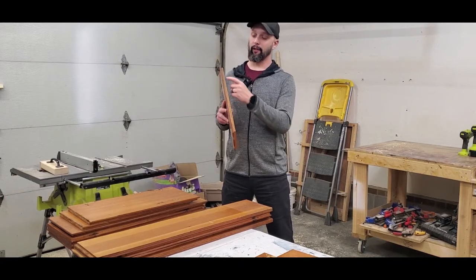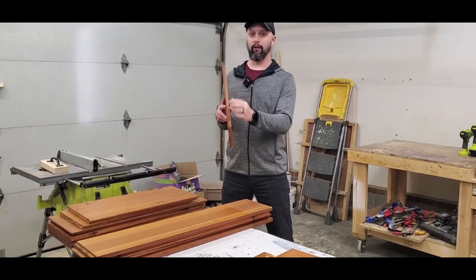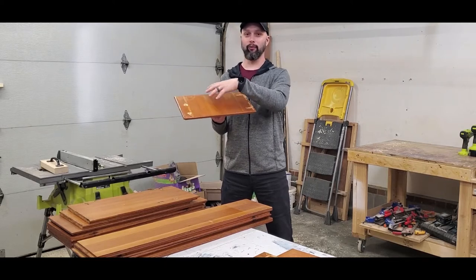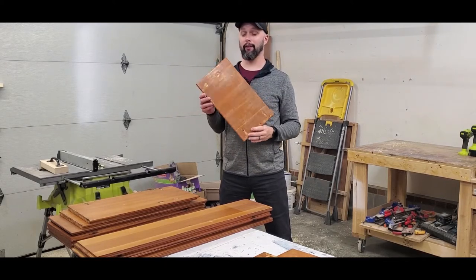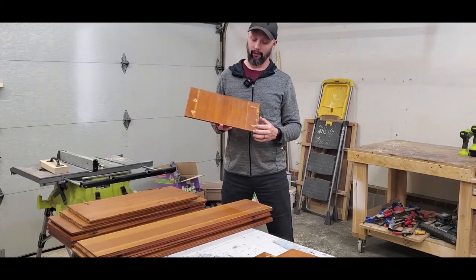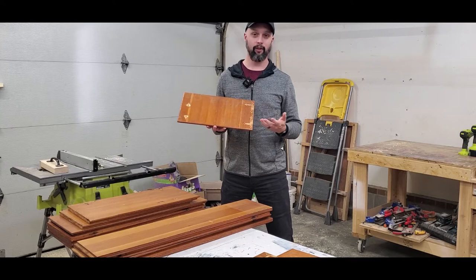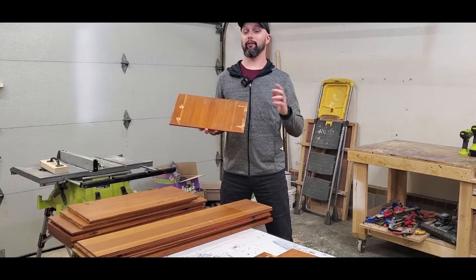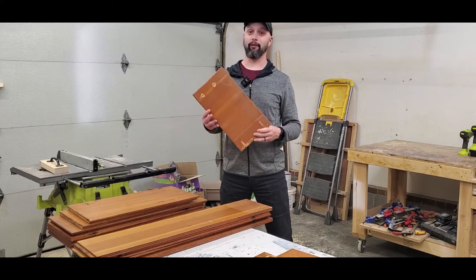The first thing I'm going to do is cut off these lips and add some hardwood around the edges. I'm going to plane them down to get all the old 1960s shellac off there, and I am going to add a shaker style border on the front. Then we will update the hardware and the hinges and really bring these doors into the 21st century, Flash Gordon style.